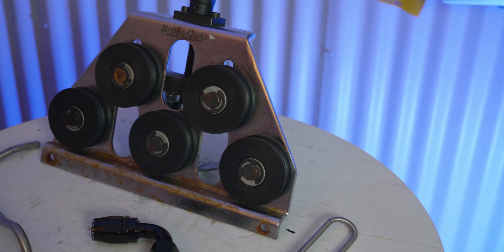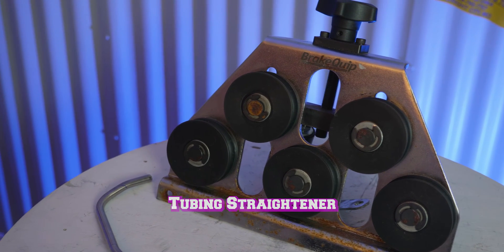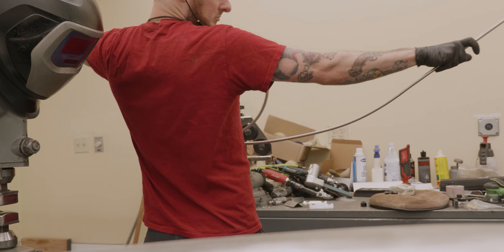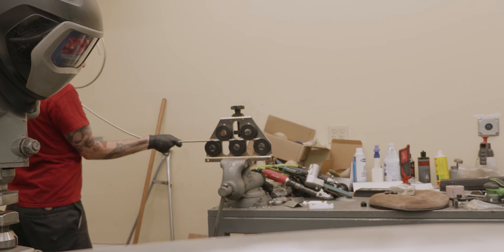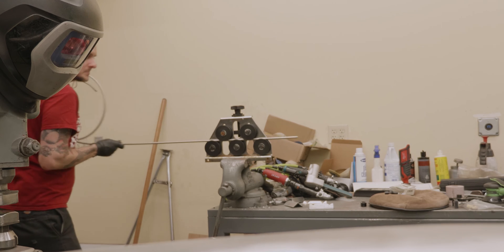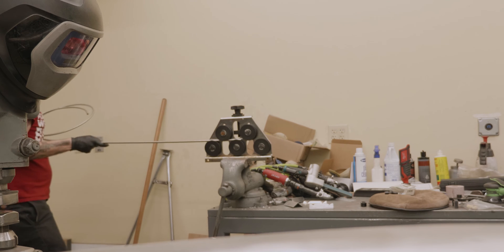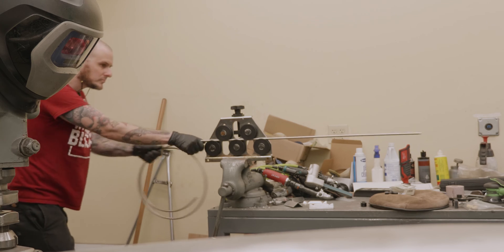A tool I recommend — though you don't need it — is a tubing straightener. I buy tubing in rolls because it takes up less space, it's cheaper to ship, and it's more cost-effective per foot than pre-cut lengths. You just roll it out by hand, feed it through the tubing straightener, and slightly increase the pressure as you go. The rollers straighten the tubing as it feeds through. I generally rotate the tubing and run it from a couple of different directions. Be careful: applying too much pressure will start to bow the piece like a ring roller.